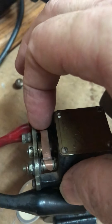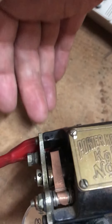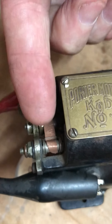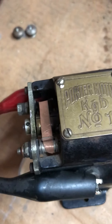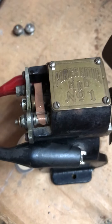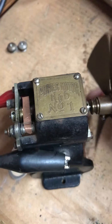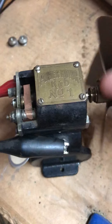...it was just a strip of copper. There's one across the bottom coming from this side of the motor, and then down underneath there's another brush — I don't think we're going to be able to see it — but there's another brush coming from this side that rubs the commutator, just like this one coming from this side going that way. These were called 'brushes' because the copper strip just brushed that commutator as it spun around.